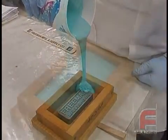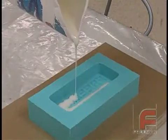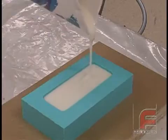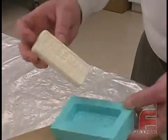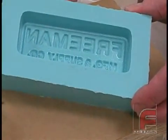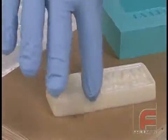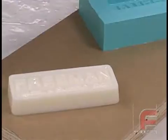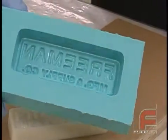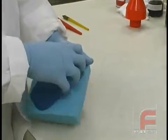Also, you do need to be careful when pouring certain urethanes into molds made from these materials. To demonstrate, we've made a mold out of V1065, and in it we've poured our Freeman 1040 flexible urethane. The next day, we get a clean release, but the surface of our part is sticky and the surface of our mold is still wet. Even the following day, the part still hasn't cured and in fact never will fully cure. Many urethanes will work fine with condensation cure rubbers, but since these exceptions do exist, we normally recommend this chemistry for polyester castings and we recommend addition cure rubber for urethane castings.